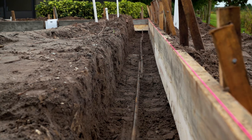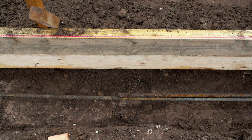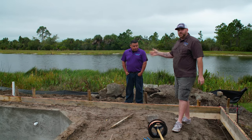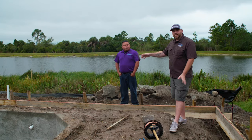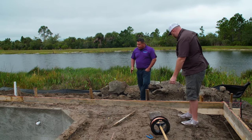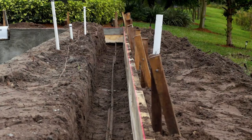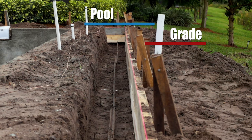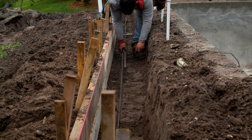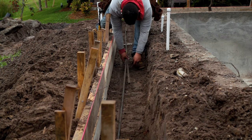The reasoning for the extended footer — I'm going to hand you off to Lee. He's going to explain in more depth why we did the extended footer on the back side and the sides of this deck. The only reason we did the extended footer here is because the grade is low. We have to bring down the grade, and that's why we made an 18-inch footer here so the dirt didn't wash out.